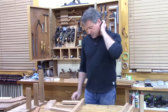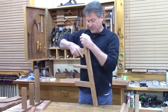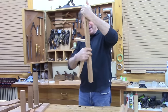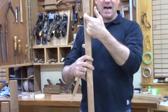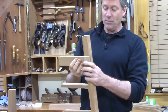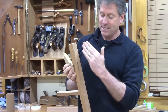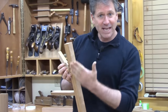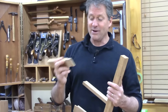Here's one that's interesting — you see this a lot on craftsman-style furniture where the tenon goes all the way through. You come in from both sides, the mortise is cut all the way through so the tenon can extend out the other side. The tenon is chamfered and sits proud about almost an eighth of an inch typically, and you chamfer the edge and burnish it. It looks really sweet.